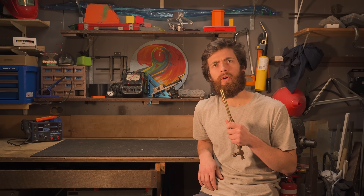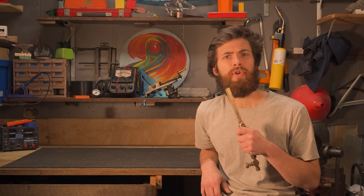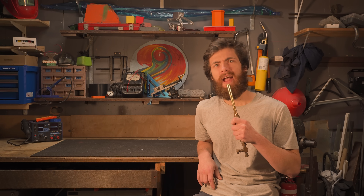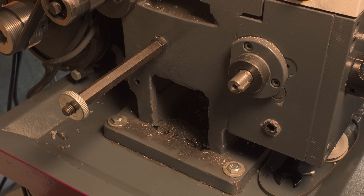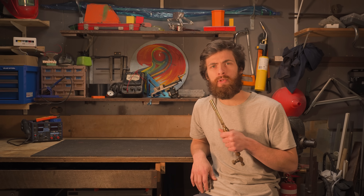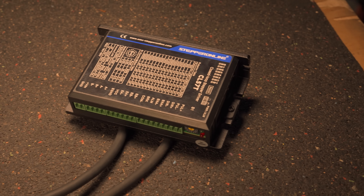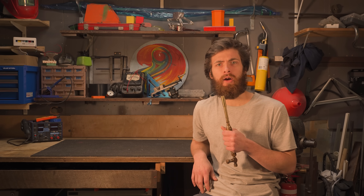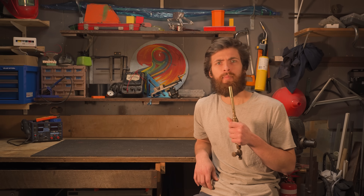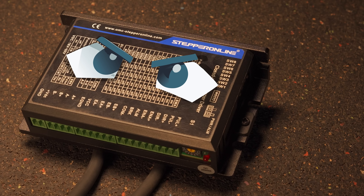So now that I had something that looked like it worked, it was time to give it complete control of a 300kg spinning death machine to make sure that it actually worked. To drive the lead screw and feed shaft, I decided to go with a closed loop NEMA 24 stepper motor, not least of all because it fits real nice in this here gap. Closed loop motors have an encoder of their own, which is really handy in situations where you want the motor to do exactly what you tell it to. If it isn't where it should be, it'll try to get there with some gentle encouragement, and if it's still stuck, it'll throw an alarm and give you a scolding look that says: you should have picked a bigger motor.